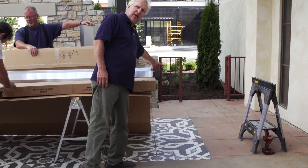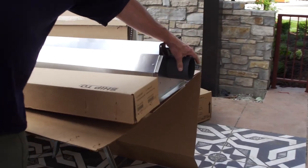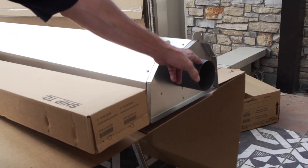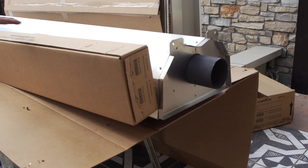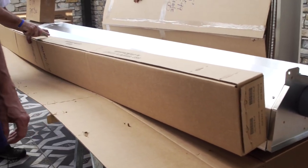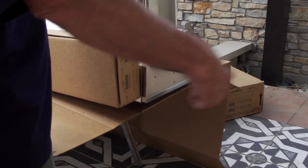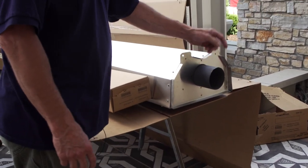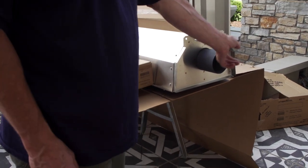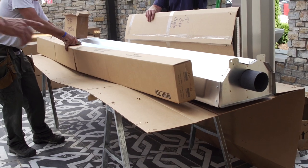This is not the typical end that you saw on the PHS-40. This is meant to be extended, so we will be attaching our additional pipe to the pipe that protrudes from the end of the unit. Also inside this box is what's called a baffle. A baffle is really a turbulator that mixes up the flue gases, keeping them moving so we can have better heat exchange on the latter part of the unit to keep the heat output up.